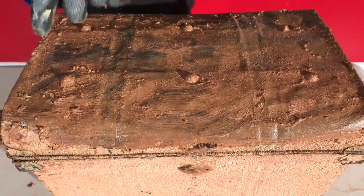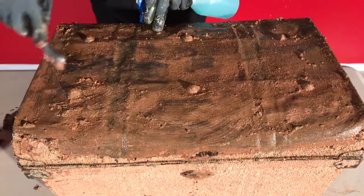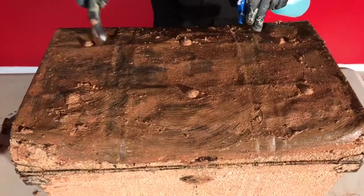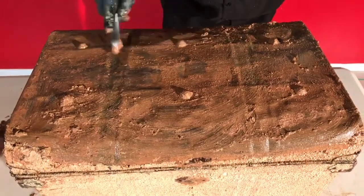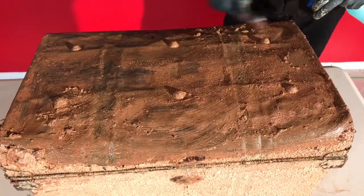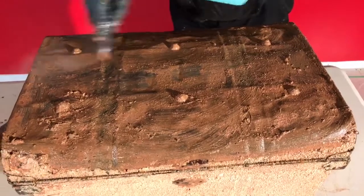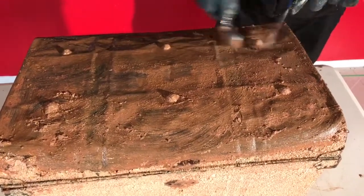So this blue liquid is our flusher, and it's a paraffin-based spirit. And we're just using this as, what we're doing here is a pre-rinse. We're really just finding out how far we've got, because we are probably going to go on with more stripper. But before we put the stripper on, let's get rid of all that goo that's there.